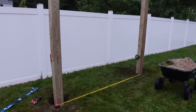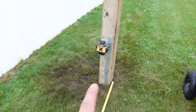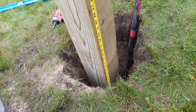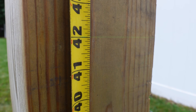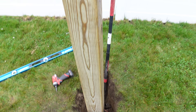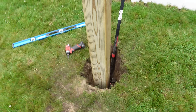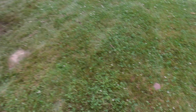Once the rain stopped, I dug the second hole and got the bucket all the way down. I set up my laser level - this thing is awesome. Top of the bucket is 42 inches, so I put the laser on that line and measured down to confirm the depth. You can see right where the green line hits - exactly 42 inches - that's exactly what I need. Center to center is exactly eight foot six, exactly what I wanted. Four feet off the fence, back-filled and leveled, and we're good to go.